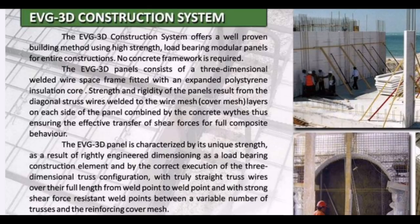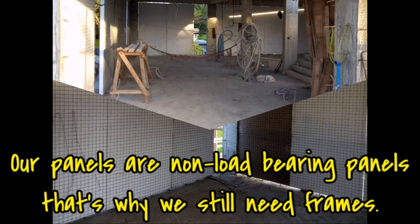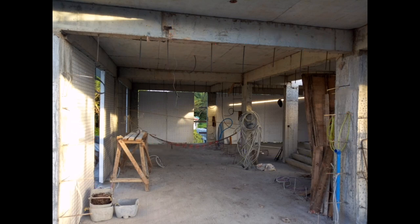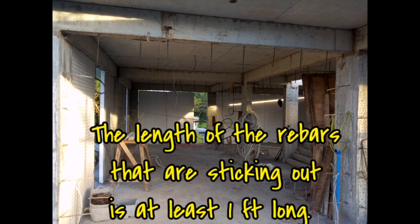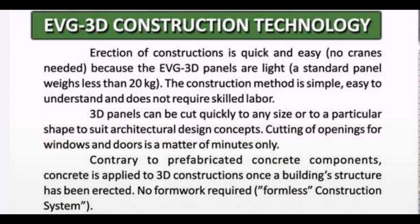I'll give you a fast summary on the construction of the panels on our house. We need a frame because our panels are non-load bearing modular panels, unlike the ones in the brochure. In this photo, you can see that the panels are already on and the things sticking out are the rebars. Rebars should be at least one foot long from the cement so you can attach them through the panels — it doesn't matter if it's at the back or the front as long as it is connected to the panels. Putting the pipes, wires, and switches inside the panels is really easy.